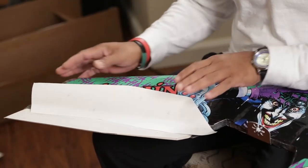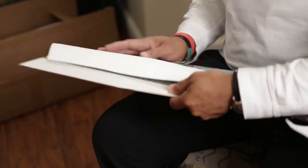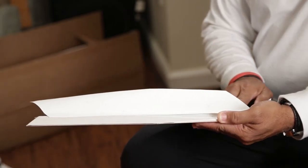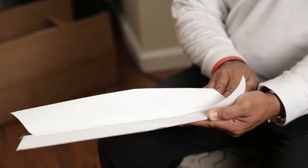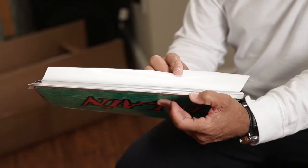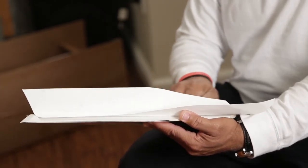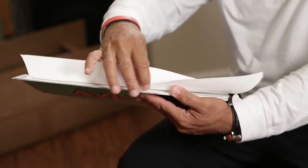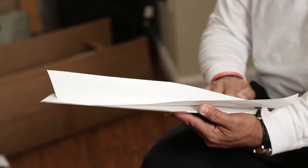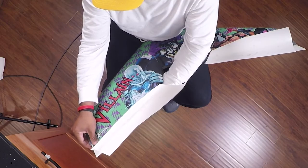Before I do that, let's roll the wrap onto the elevons so we can get that finally in place. We're going to do it just like we did when we laminated our elevons onto the wing — I'm going to hold this out of the way and run my fingers along here with it held at full deflection, as far back as it'll go, and run my finger along here until I get all of this covering over onto my elevon smoothly. Just work it with your fingers to get it all the way down.